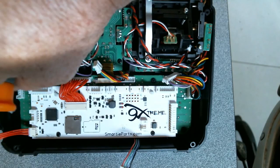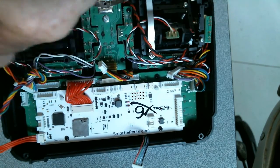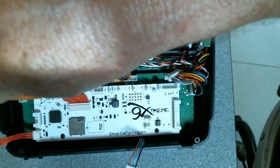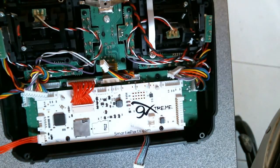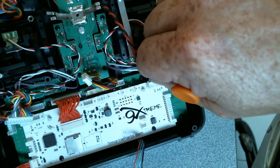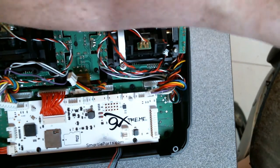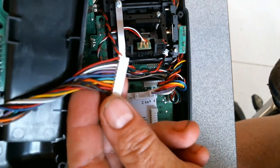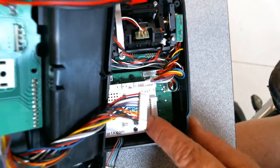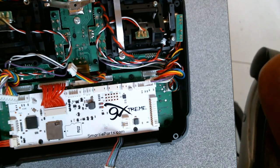The remaining plugs that we left out now go in. There's a 5-pin that goes to the 5-pin hole. Then there's a 9-pin connector that goes there. And another 9-pin — sorry about that — that goes there too. The only one that remains on your board is over here, and your back case connector goes into this group of pins here. I'll get all those pushed in and we'll come back and show you it all together before we put the back on.